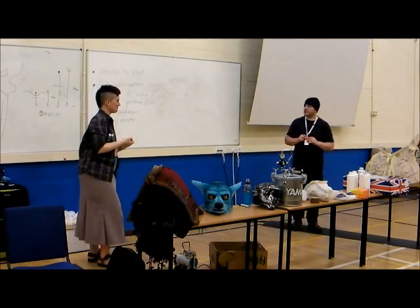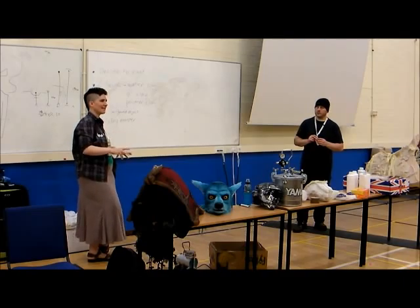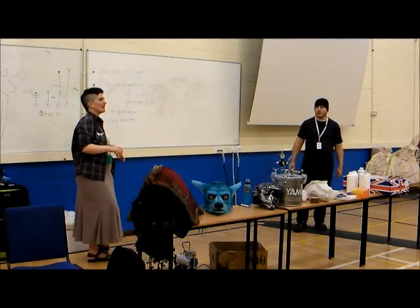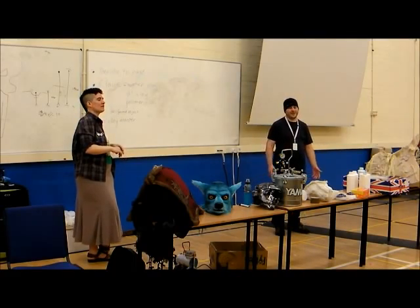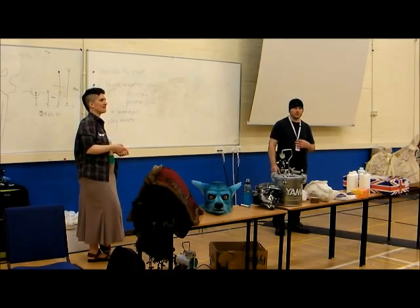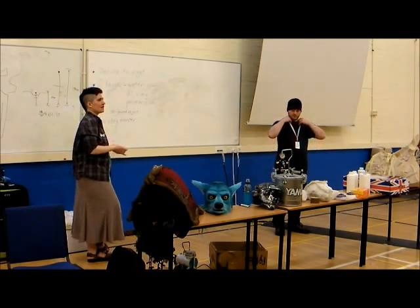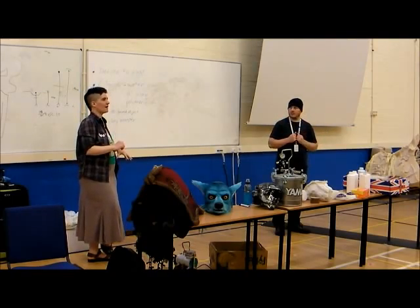Yeah. Oil clays. These are when the dirt portion of the clay is dried out completely into a powder, basically. And instead of hydrating it with water, they mix it with various oils and waxes. The most common form of this is plasticine. You've all played with plasticine. Never dries out, stays the same. You can heat it up to make it easier to work. And if you cool it down, it becomes very hard.